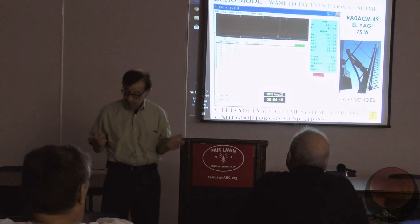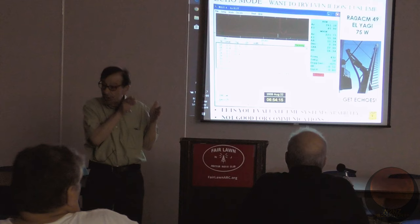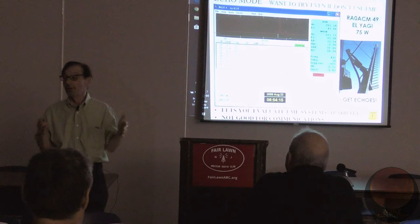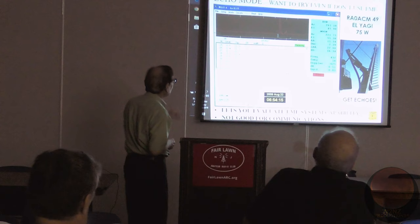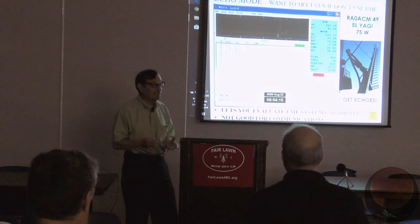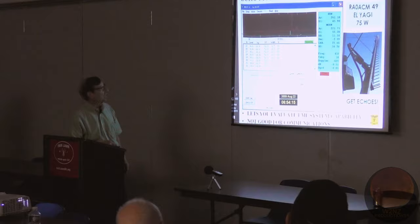You use the JT mode, and it is kind of like that system I talked about that was developed in Hungary, the first to hear echoes, where they repeated the signal. It does the same thing. It sends the signal repeatedly, it knows where to look, it adds those together, and it gives you the ability to hear a very, very weak signal. So you can hear signals using the echo mode that you couldn't even communicate with someone with. But it gives you an idea: my system's working, I'm getting echoes, but it's a little weak, so I have to do this to improve it. It's a way of getting feedback when you first start up. And you don't have to have anyone around, it works very well. From my point of view, not enough people take advantage of it.